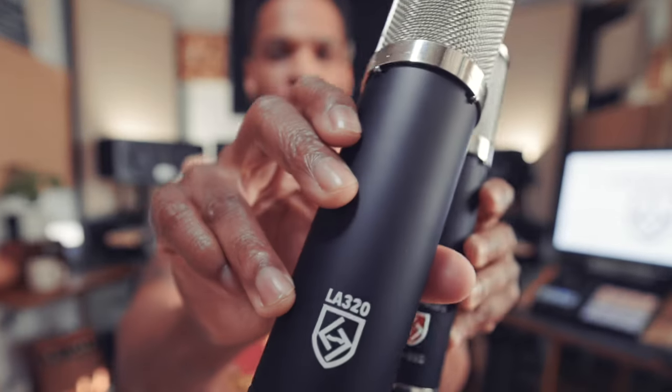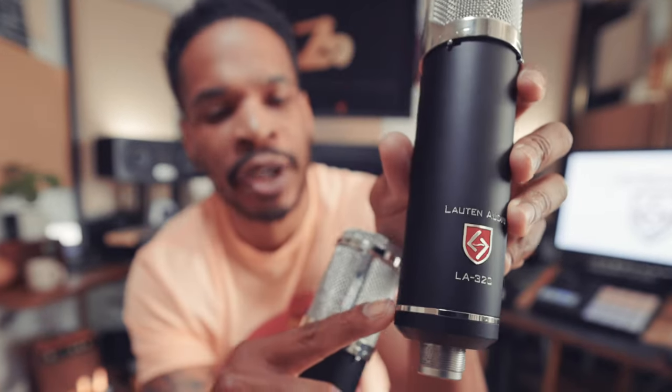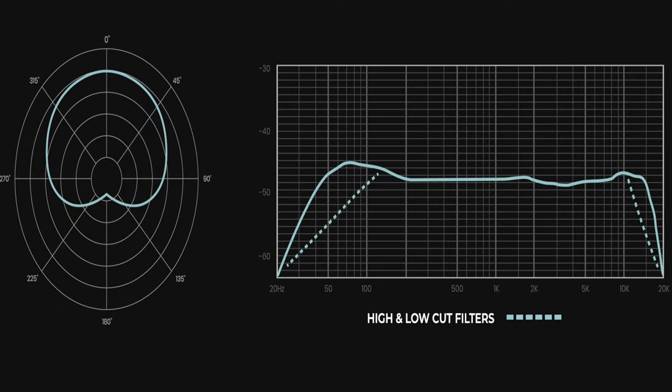I love my V1, and they've improved on it with the V2. What's changed between the V1 and the V2? They've rounded off the top of the head — that's going to affect the sound. V1 looks hand-painted. From V1 to V2 there's a nice little added ring at the bottom. They've updated the capsule on the inside and updated the tubes. For version 1 they went with the Sino 12AX7; for V2, the ECC83 — giving you more body, a more full sound, a better tube. They've updated the capsule design, improved the tuning, updated the accuracy, giving you a more open top end and a more concise mid-range. And they've gone with a better shock mount. So is the mic an upgrade? Absolutely. All of this adds to the improved look, improved feel, and most importantly, the improved sound.